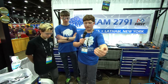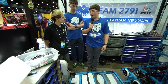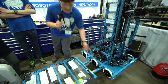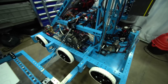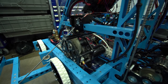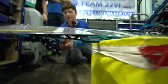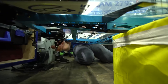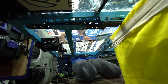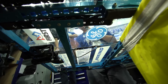We front-load, so the robot drives on from the front. Once they're on the ramps, we fire the PTO on our drivetrain gearbox, which allows us to really utilize the power of our drivetrain to raise up the ramps. We pull those up from this winch right here, which is 3D printed inside of our drivetrain. One really cool thing is the way we overcome the mechanical advantage working against us — pulling in this direction and raising up — using this kicker at the bottom. When we pull on the ramp rope to tow it up, we fire this kicker, which actually pushes down on the ramps and gives us straight down force. That allows us to raise the ramps up about four inches before we start pulling them over, and overcome the mechanical advantage to raise up a robot.